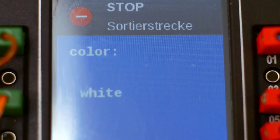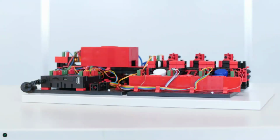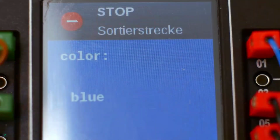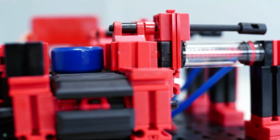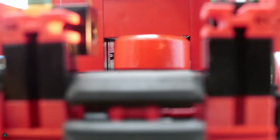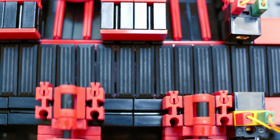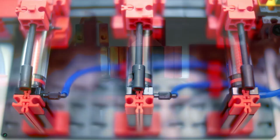Now as before, the 24-volt version, of course, has the motor relay board for motor polarity reversal and both a multi-pin connector, 34 pins with a grid of 2.54 millimeters, as well as additional PCB terminals with push-in connections for all inputs and outputs. And again, the end user needs to provide the PLC and the programming. And the 9-volt version, of course, comes pre-wired to a pre-programmed Robotics TXT controller. And in that case, one 120-volt power adapter is required for use.